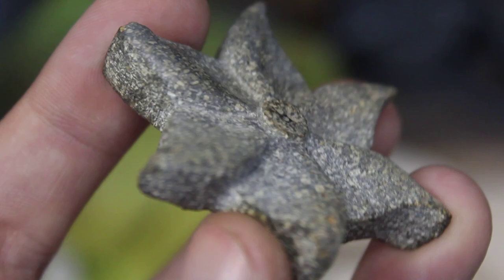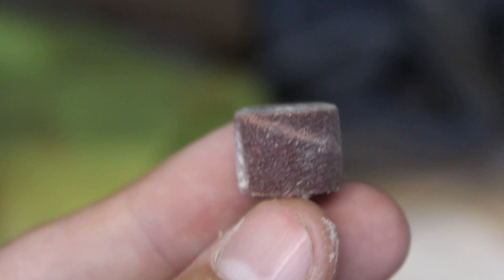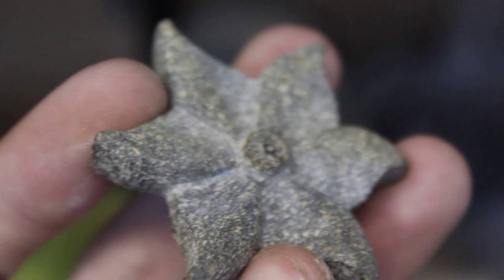That's what it looks like now that it's been all cut out and shaped. I think it looks pretty good. So from here, I'm going to take one of these and go over pretty much everything so I can get rid of the track marks from the burrs. And then after I use that, I don't know if you can hear that thunder or not, I'll come in with this flap sander, and that will actually lightly polish the piece. If you look, I already did it to one petal, so that gets you a base polish, and from there you can use buffing compounds or sandpaper or even just a clear coat. But yeah, I'll do that now.